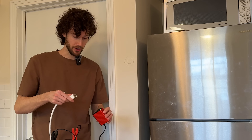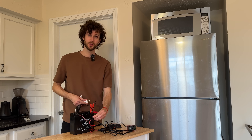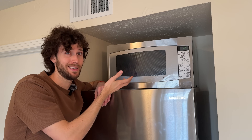Can it run a kitchen fridge? No — this thing pulls up to 300 watts, so our fuse would blow if we connected it, and without a fuse it would overload the inverter. Same thing goes for the AC unit: definitely not.